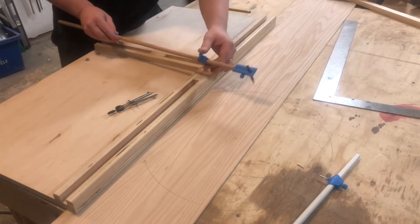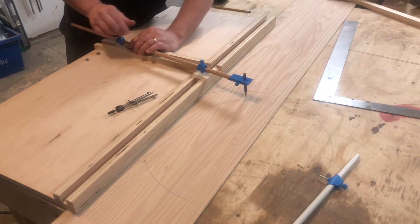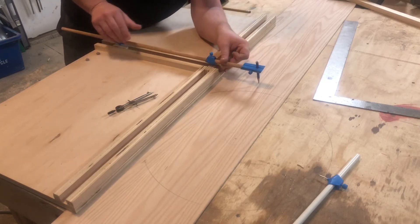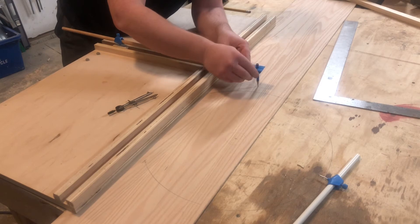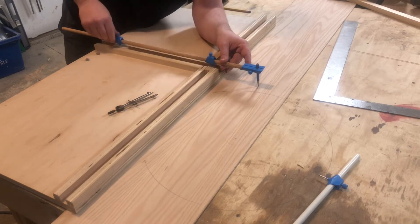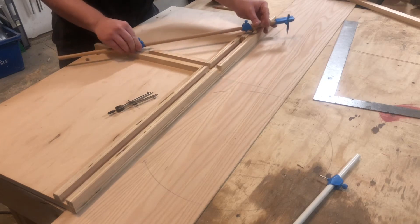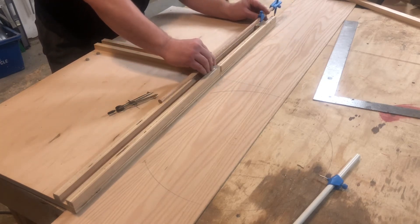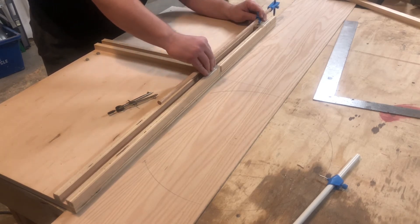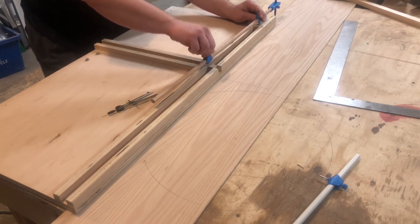To set this, I put one compass into that block and one compass into that block. I'm going to loosen both of these up and put this in the dead center, then loosen this up so the pencil can drop. When I tighten this one up it cannot move anymore — it's locked in. I'm going to raise it up so it doesn't move, then take it back out to the 20 inch mark, get this in the center, and lock that one in.